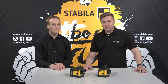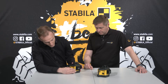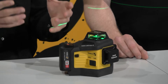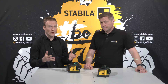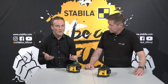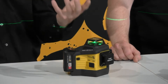Can you show us how to operate the laser and turn the lines off and on? Of course. When you switch on the laser it will start only with the horizontal line. This is ideal because it is often used for exact height transfers and precise layout work. It also extends the run time, because if the laser started with all three lines every time, the power consumption would be unnecessarily high. However, many manufacturers do this because the show effect in the shop is then higher.